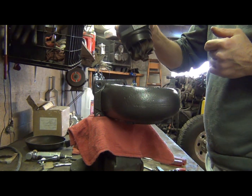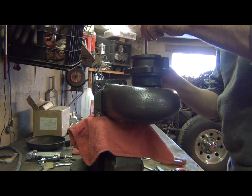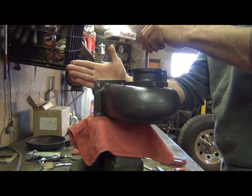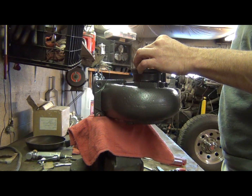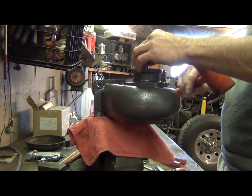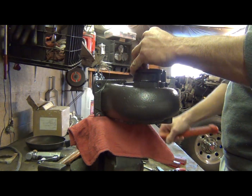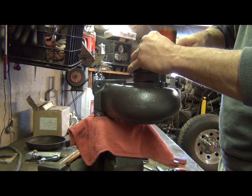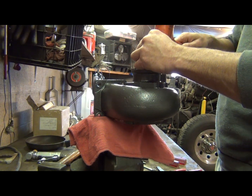Now we need to put this in here. This goes like this — this is the bottom side. You can see the oil hose where it bolts to the pedestal, and here's the exhaust flange, so this should go on just like that. If you take it apart, you might want to take some pictures or at least make a mental note of that. When you seat this down in there it's kind of a snug fit. That fan blade is kind of a close fit until you get all the way down in there flush. If you get it in there crooked and try to force it, there's a chance you could break one of the blades.